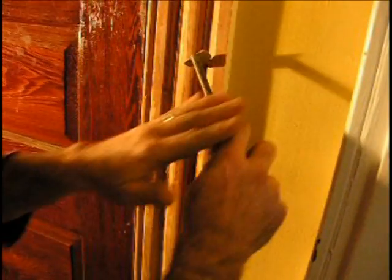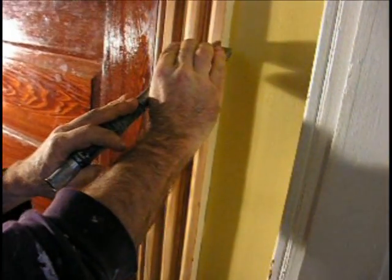Jill and I have learned, here's trick number 1. If we keep our tools really sharp, we can scrape off a top layer of the wood, just shaving the wood. Essentially what we're doing is we're sanding the wood with our scraping tools, and this gets out that paint saturated wood. And as you see here, I have a rounded tool that I'm moving through the gully.